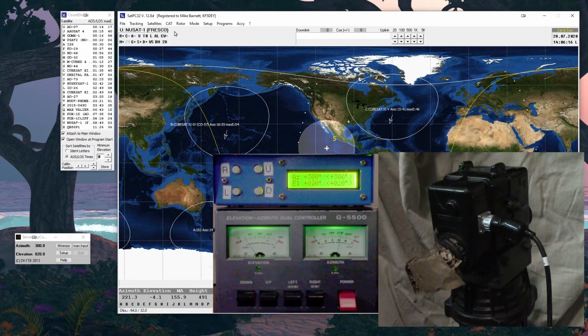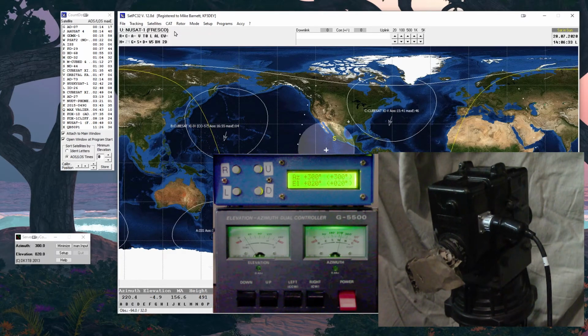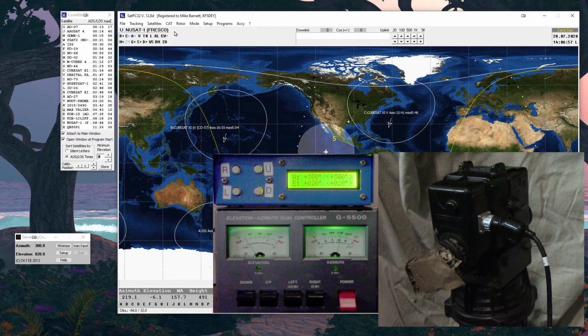Again, north alignment, once you get the antennas level to the horizon, level to the earth, mounted safely, securely, and square to the path. So once you've done all that, now we have to have some way to route the cabling, the coax, to them. The best way I think to do that, like I showed and mentioned in my write-up, is you rotate it all the way to the left, and run the coax the same direction the rotor cable goes. We'll have to secure them obviously, but that'll give you your plane of motion, so it's wrapped around the same way that the elevation cable is.